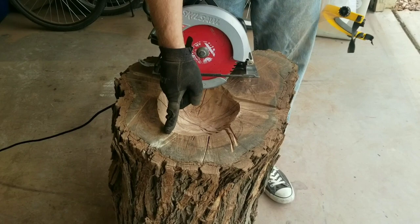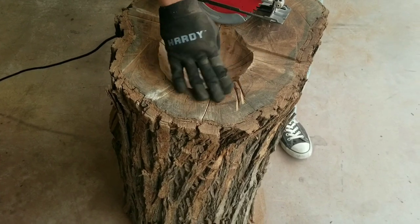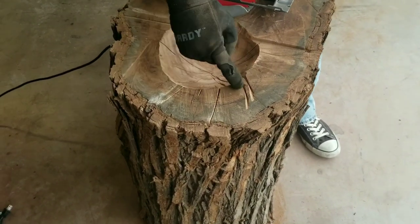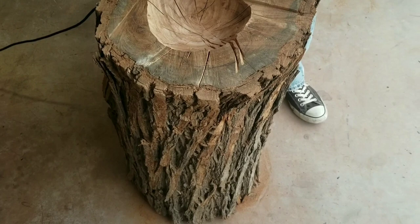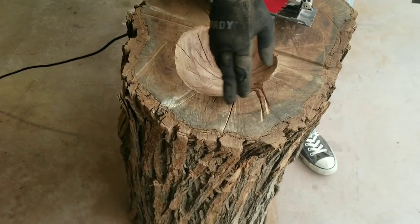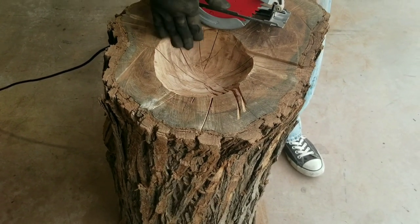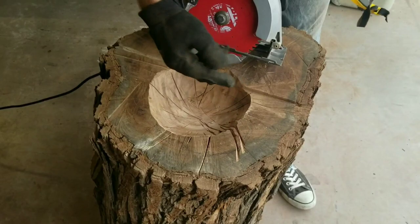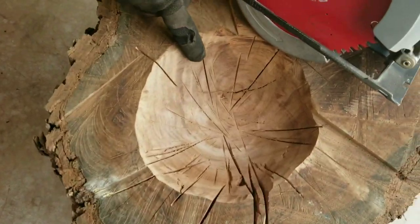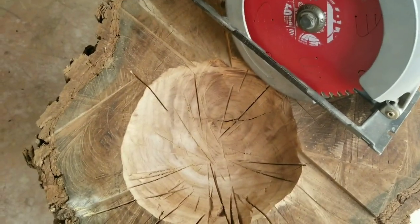Slight change of plan. Looking at my wire form, I decided I wanted two different profiles — a deep profile and a slightly shallower profile. So I'm going to mark out where these errant cuts are to the edges and grind out the rest, taking the deep part as one zone and making the other half as deep as this but with less slope. I'll have a shallower area here and a deeper area there for different profiles to work into the stump, so when you're shaping something you have more than one spot to work from. I'll do the same process: saw, chisel, and grinder. The rest is looking pretty smooth — just a little more grinding to remove the last cuts, and I'm pretty happy with it so far.